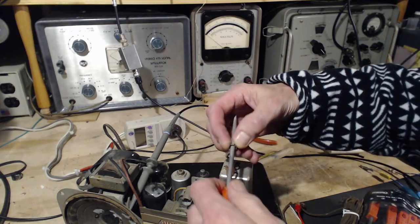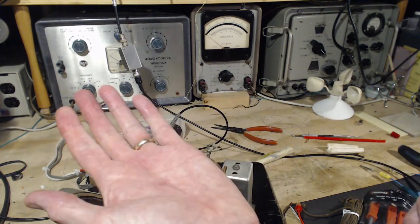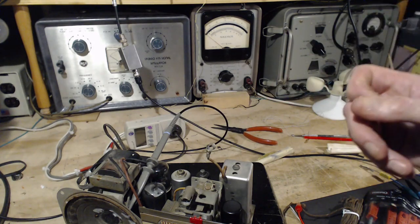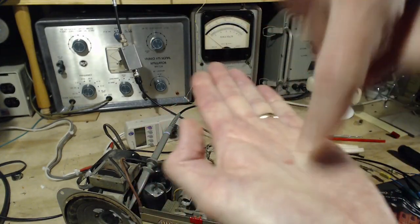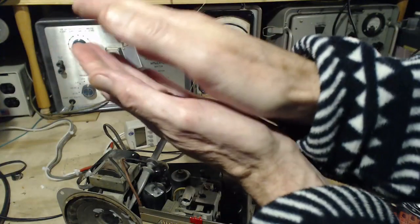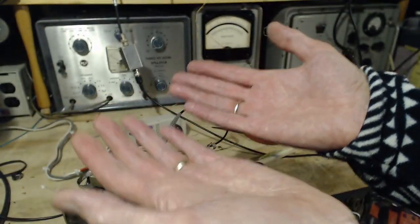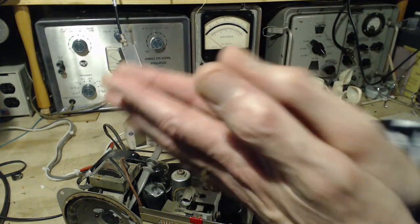There's a theory out there, which I don't really buy into, but it says that if you mate together 2 pieces of metal, and this would be in the case of, say, look how sweaty I am today. What's going on? I'm not working that hard. If you mate together 2 connections, and you can picture this in a power company situation with big cables, big lugs, a lug the size of my hand, and another one put onto it like this, big bolts, maybe 4 bolts going through it to hold it down, and that's the bolted connection. There's a theory that says no matter what you do, there's only 3 points of contact under there. If you think about it for a bit, you can kind of understand why that might be said, 3 points of contact. I personally don't buy it, because I think you clamp down the bolts and it bends the metal and creates more and more contact.